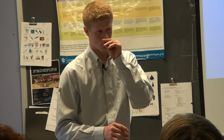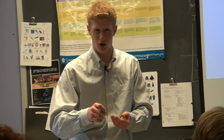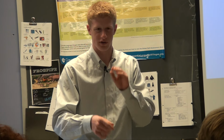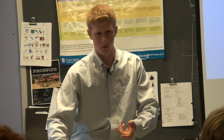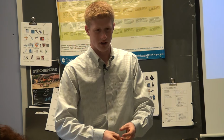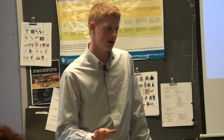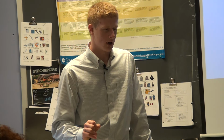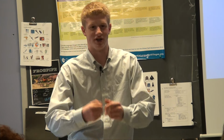Anyway, there are some ways that you can go about telling it. They make crayons that melt at different heats. You make a mark here and a mark there with three different ones, let's say, and when it reaches a certain temperature, it melts away. And you know, oh, it's at 500 degrees now. But mostly it's from the color of it. That's why a lot of blacksmith shops are really dark and dingy, so you can see the colors. Oh, that makes sense.